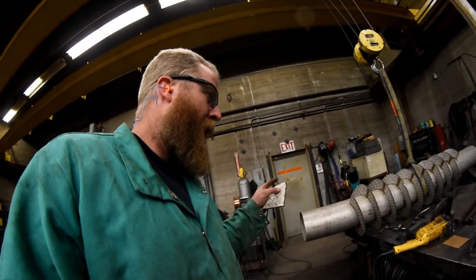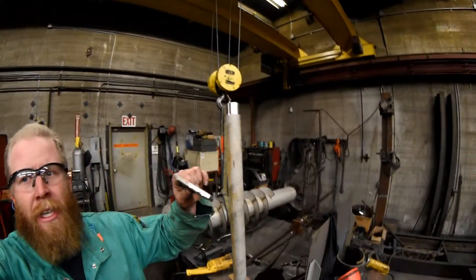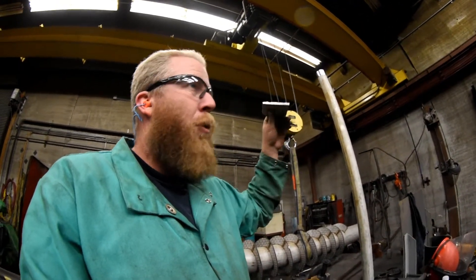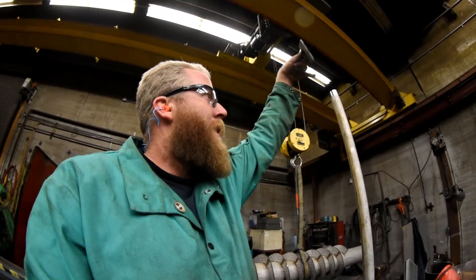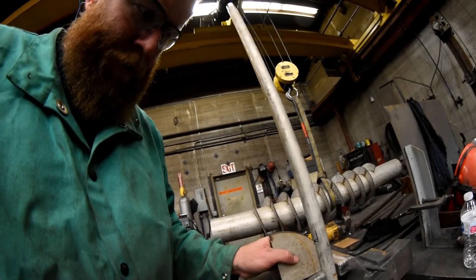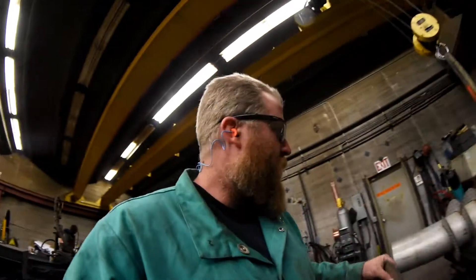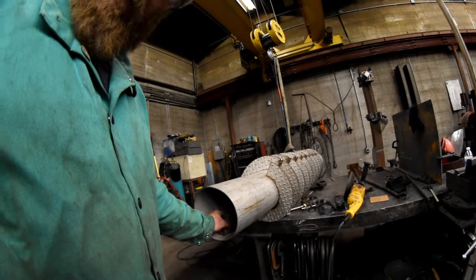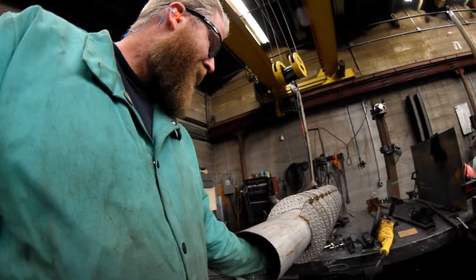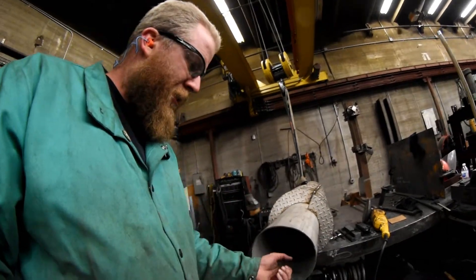This thing is going to be so hot that I can't have a bearing or anything on it. So what I'm going to do with this pipe — I already got it machined down for a bearing on top. That's going to be sticking outside of the cabinet — it's kind of an outboard bearing, basically, so that the heat doesn't get to it. I think I'm going to have to blow air down the pipe back toward the unit to keep this cool. I've got four of these and I'm going to set them just like this all the way around, four quadrants — those are going to be the spacers. When I insert that thing into the pipe it'll center itself, and then I can weld these to the pipe to help hold it. Then I'm going to put an end cap on this with a hole in it that the pipe will come through and I'll weld it, so it'll be held in two places and not just relying on this end cap.